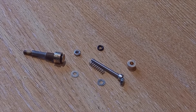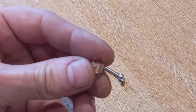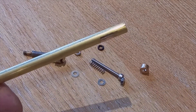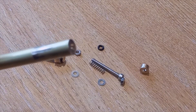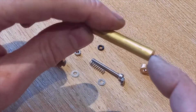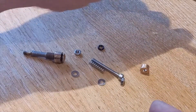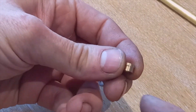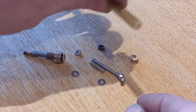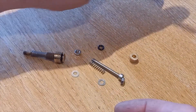The other thing I've used here is a piece of brass bar — I just picked that up at a local hardware store — with a hole drilled at the end of it. I've put a step on this, but you really don't have to; that's completely optional. It just makes it a little bit easier to put the thing together. You could do it freehand by sticking it in a vise, drilling a hole with a cordless drill, and then cutting a piece off the end. You don't need a lathe. You could just cut the end off a bar and drill a hole in the middle — it doesn't even have to be right in the middle, it just looks better if it is.